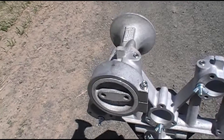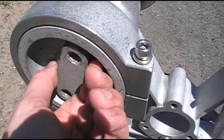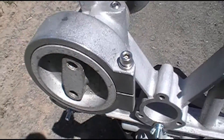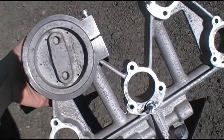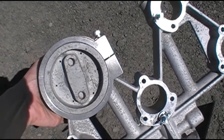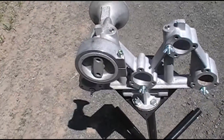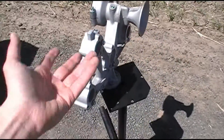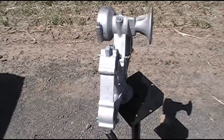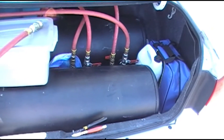Got the diaphragm in and the cap on — it's almost flush with the head but still nice and loose. I actually cheated: I just took my whole tuning rig, tipped it down while I put the cap in, so I knew the diaphragm was properly seated. That is another reason why doing a shop tune is preferable — because you can just take the whole horn off the rig and tip it down while you're putting your diaphragm in, so you know it will not be caught.